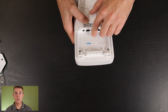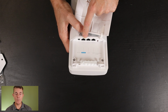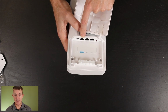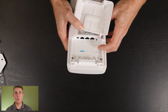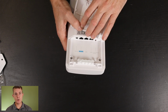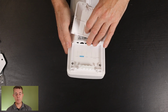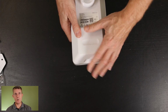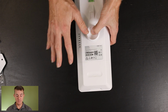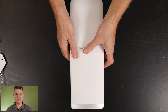You can see here then, like we said before, we have got our 12 volts in, we've got our PoE or data in, depending on what you want to do, 2 lots of data out, and we've got our reset switch or our quick provisioning. So you can use the software again to easily scan and add the multiple endpoints together for this. All of those ports are 1 gig. This will support up to about 5 kilometers and, like I said, up to about 16 endpoint devices connected. So hopefully that's been useful.